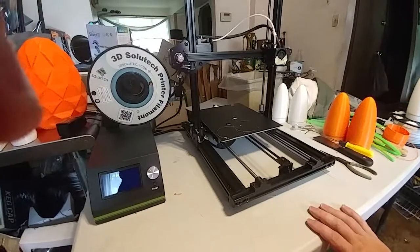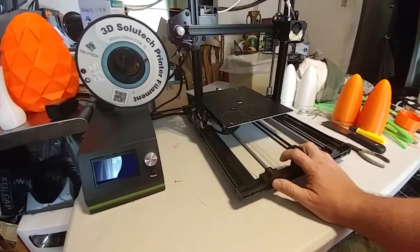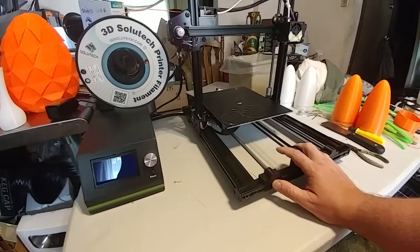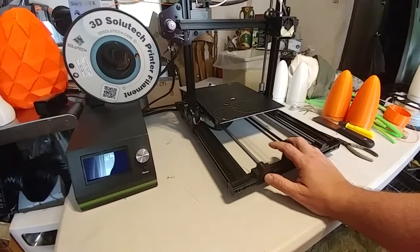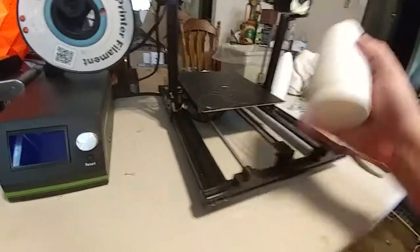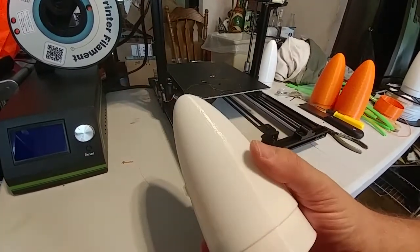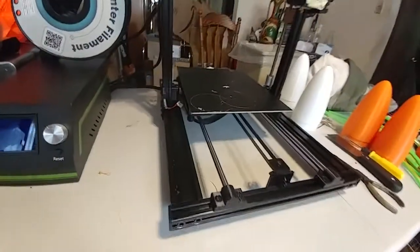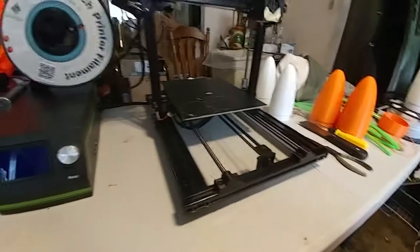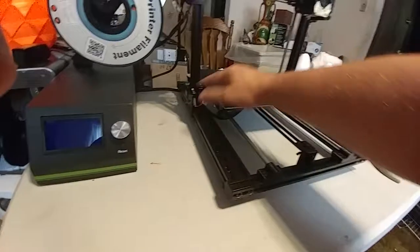This is truly a very, very nice printer for the price. If you guys can keep this at $300 and make a couple of those slight QC upgrades, I think you'll have a really solid printer. The print quality is absolutely fantastic, especially once you turn down the jerk and acceleration. Key fixes: change that jerk and acceleration, fix the QC problems, and rotate the three motors so the two Z-motors face backwards and the Y-motor faces sideways.